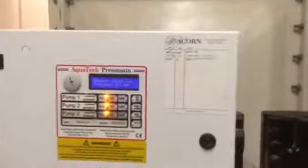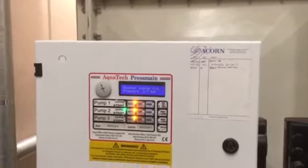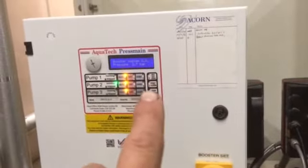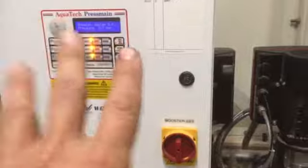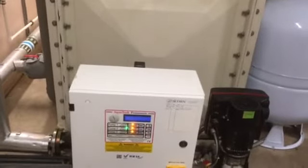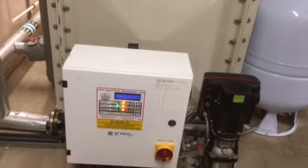These are modulating as they should be — off, off, on at quite a high rate. Running at 2.7 bar, and assuming there's no load, we want to see it shut down in a minute to make sure it's going into a stable stationary state. In short: reset there, on and off — it just can't cope with a power cut. Reset there, press on at the pumps at the back, each one. Wait for things to start happening, then press on again on the pumps at the back. Make sure you don't leave any of it in hand — make sure it's all in auto.